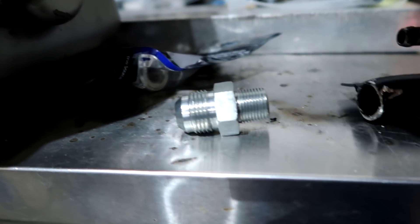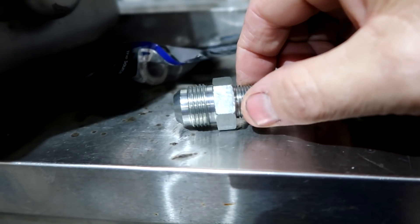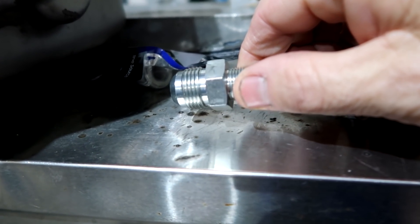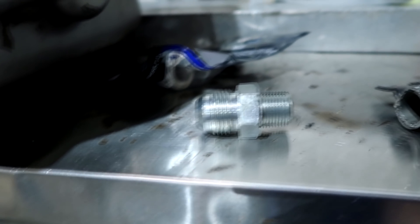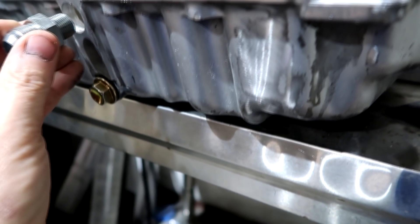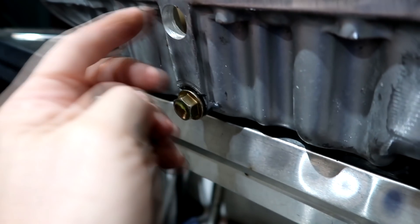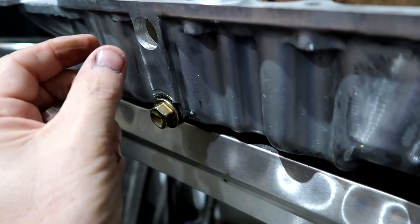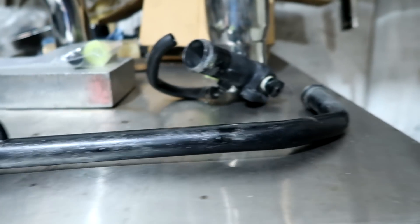Don't do it where it's going to cause an issue. If this goes through there, when you're tightening the drain onto this, it will constantly spin and it's going to work its way loose, or the seal is going to fail. It's going to leak - you're going to have that typical turbo kit where it leaks oil from every possible location, so it's no good. Basically, put a fitting in and weld down there. This is steel by the way - it has to be aluminum if it's an aluminum pan. So what I like to do is weld it directly on there.